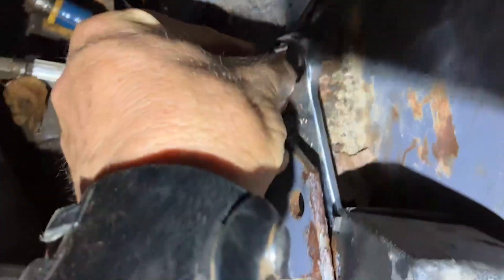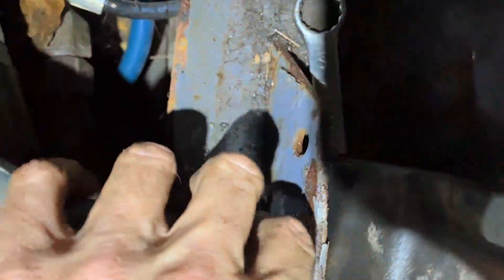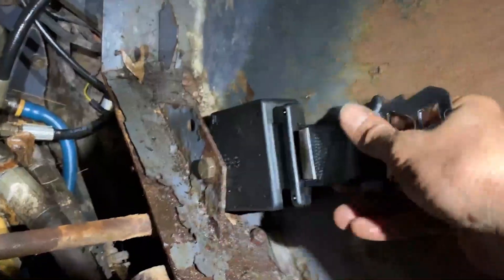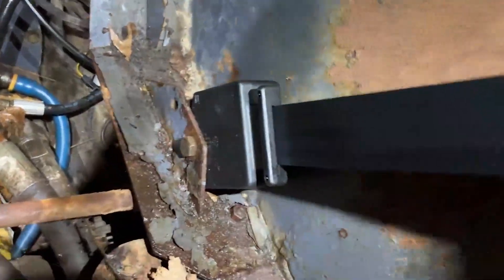I just wanted to show you before I pulled it out. I put a three-quarter inch on the impact here on the front, and then I had to get a little stubby three-quarter to slide back in here and get it on that nut behind there. That pretty much did the job — took it off of there. Now this should just pull out of there like that. We're going to take our new one and slide it down in there and same thing, tighten it up. The new one's in. Just remember, you might need to tilt this on some type of angle because if you put it straight up it might be a really uncomfortable fit over the operator — our last one was kind of tilted forward. It's in and it's tight. Now we're going to move on to taking this bolt out here, the other part of the seat belt and our wire back here. It just disconnects just like that.